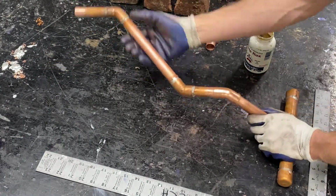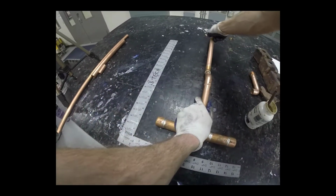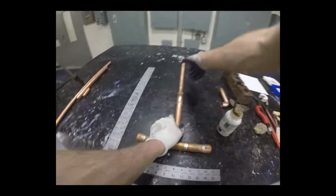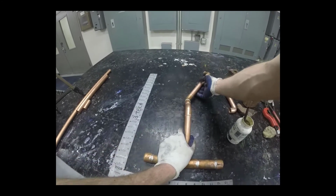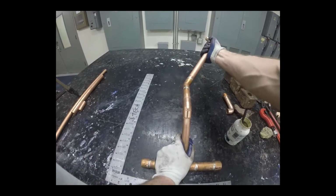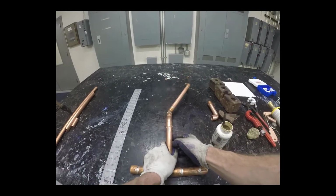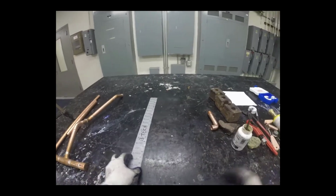With this 45 in place, I can play with and adjust the rolling offset. You can see here, I don't want it straight ahead. This needs to roll off to the right side. But how much? And how do I know when I'm accurate? Let's look at a few options for how to make sure this is done correctly. We'll set it aside for a minute.